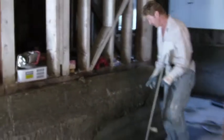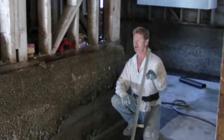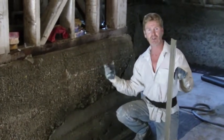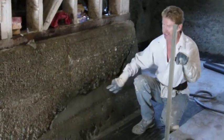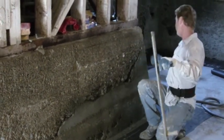The last thing I'll point out is they're placing a French drain around the entire perimeter of the house, because over the last 70 years it leaked through and deteriorated the foundation. Over here, this was more than stucco could fix — it went inside the foot, so I recommended they go ahead and concrete this area.